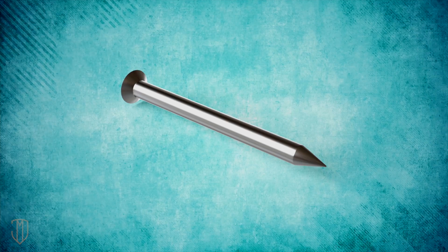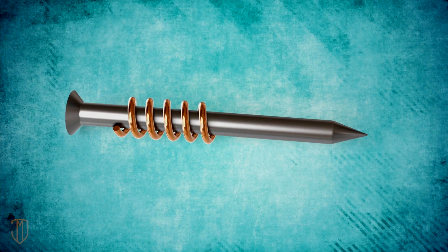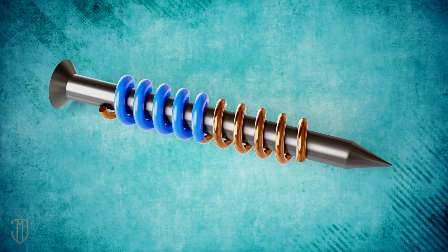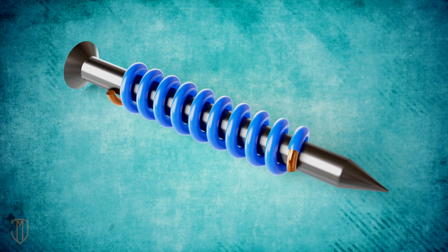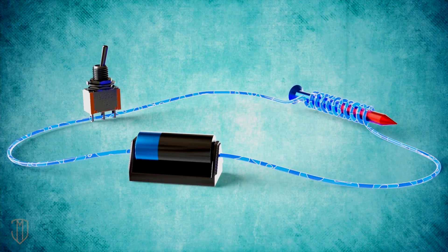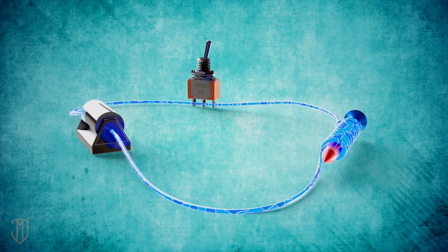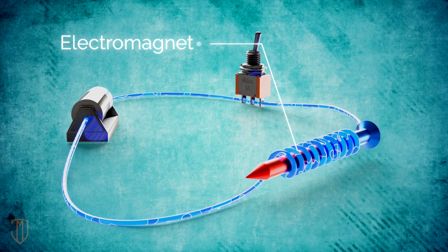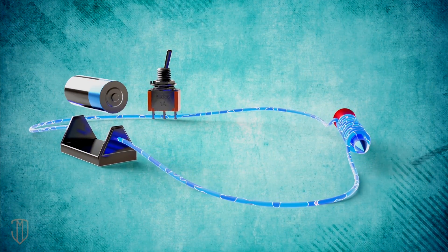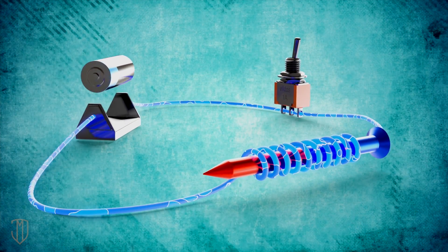This is how we create an electromagnet. We take a piece of metal that has random magnetic domains and wrap a wire around it. When a current flows through a wire, the magnetic field rotates around the wire. When we coil the wire, it allows more current to flow within a smaller distance, and this increases the magnetic field. We place it in a circuit, the magnetic domains of the metal line up, and this is an electromagnet — it effectively becomes a magnet with a north and south pole. Unlike a permanent magnet, we can turn it on or off, and we can cause the poles to switch places — just flip the battery. This changes the direction of the current, which switches the poles: north becomes south and south becomes north.